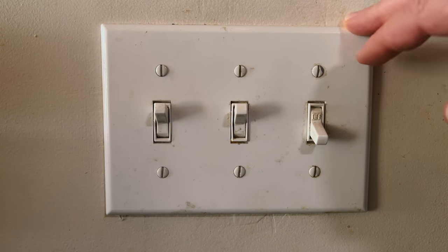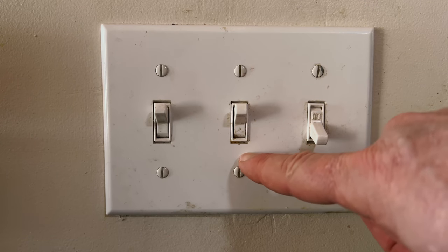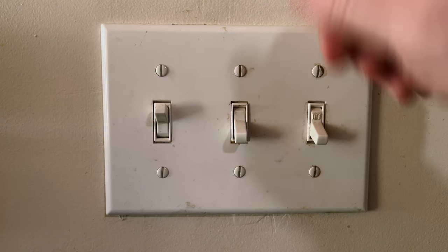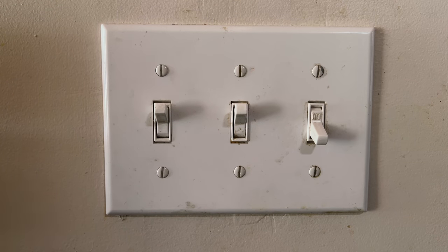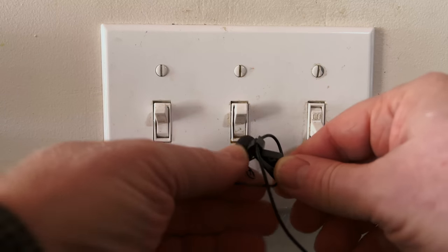One more thing — besides the fact that we need to clean the smudges on our wall. When I put the switch across the room in the position it was in when we first noticed this problem and now run this switch, it doesn't work at all. So a wire or contact is burned through. I still hear a little bit of crackling in there. That's why I simulated it before — we're in a state now where it's really broken.